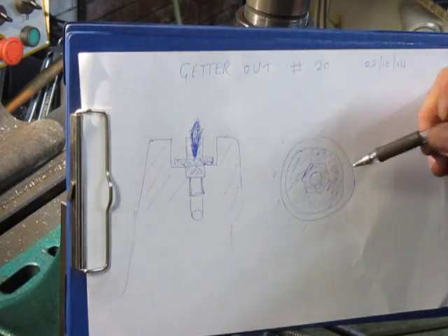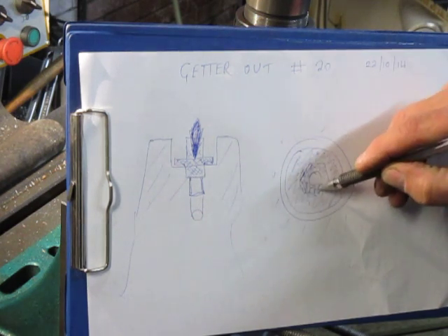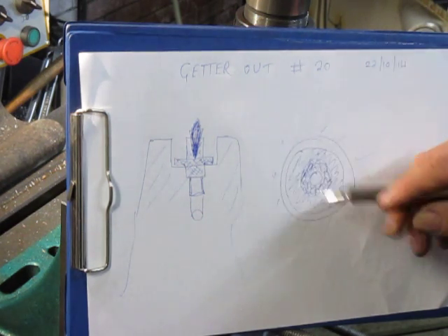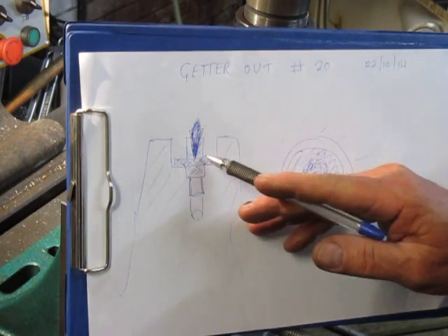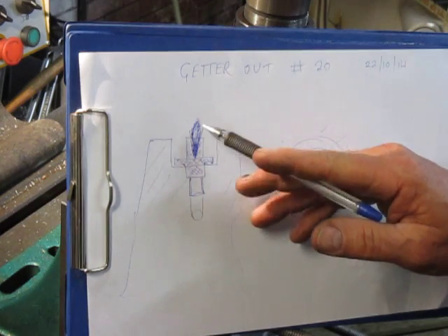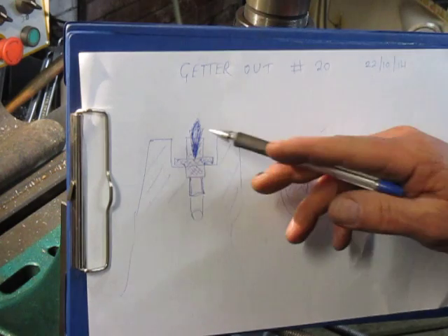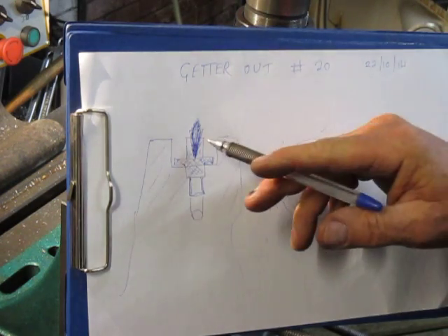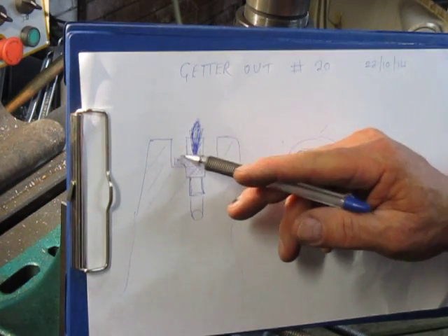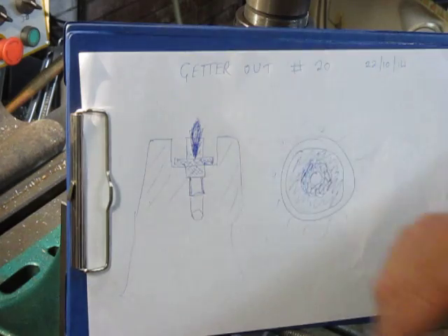This one is particularly hard, so what I've opted to do is to machine all the way around with the milling cutter — machine around until I'm only left with the washer part of it, because I don't think it's in much deeper than that — then try and unscrew this easy-out, and then proceed to bore out the head and bore through and get that plug out.